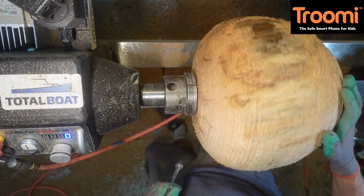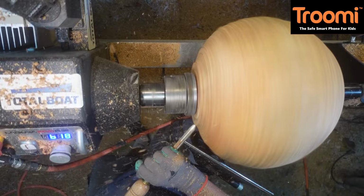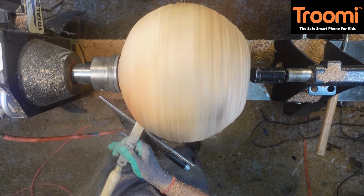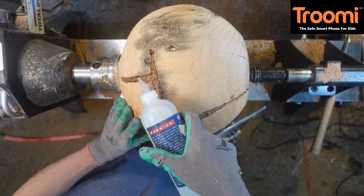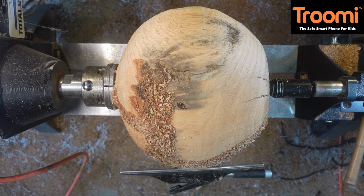But on this project, as you will see, the problem is when I do my molds, I often use sand around it and it's packed in there tight and there's a whole lot of resin plus the wood and it's really well insulated. And so the heat really builds up and this sucker cracked like nobody's business. I was fortunate that it didn't bubble. You can get to a point where it just boils and that's it, because you can't even finish that kind of surface. So I was actually lucky to walk away with anything on this project.